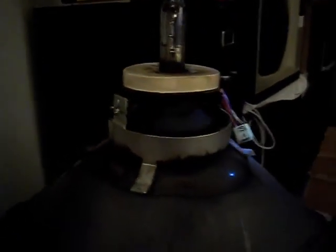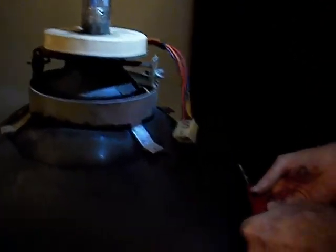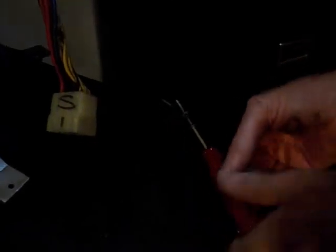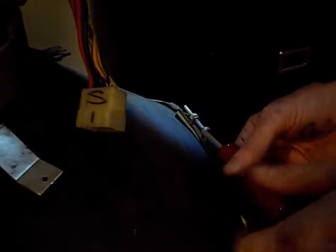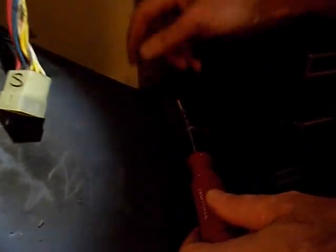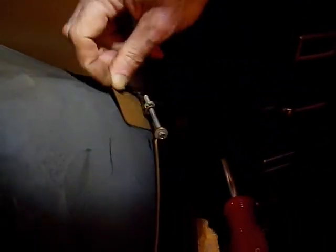In the meantime, what we'll do is work on this wire strap here — loosen this — this is the main thing that really retains this. You'll notice I still have all the springs on the corners. I've got to remember this little cardboard piece here is there to protect the CRT from any kind of trauma from that nut, so that's an important piece to remember. Pull that out and these things probably just pull out.